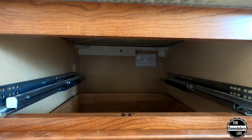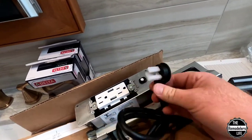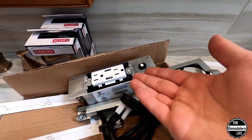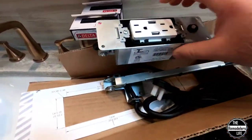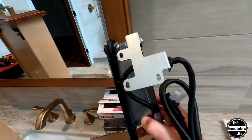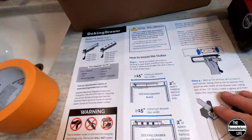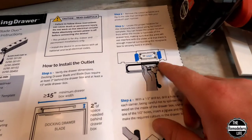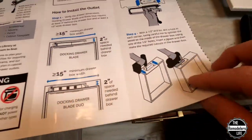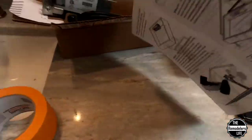It's very simple as far as pre-planning. All you have to do is put an outlet back there — that's it. There's no smurf tube, there's no nothing. You just run a standard outlet in the back of your cabinet. The docking drawer already has a plug on it with a nice slim 90-degree on it, and that just plugs into it. It's basically like an extension cord with an outlet. This nice pivoting arm here is the star of the show — it's got a nice motion to it. A couple screws on the back side get mounted to the back of the cabinet. The instructions are very easy and laid out — gives you minimum widths for the different style docking drawers. We're just doing the single blade, not the blade duo. Just tape the template onto the back of the drawer, drill it, cut it out, screw it in, put your plate, and you're good to go. Literally, it's that easy.